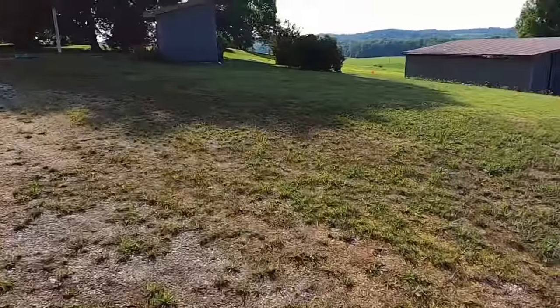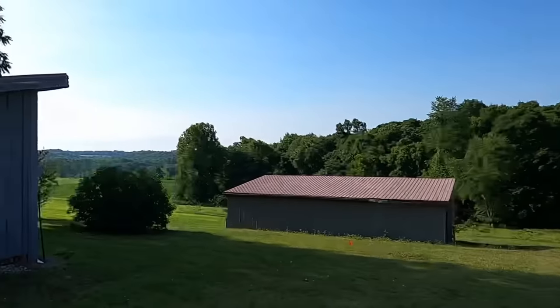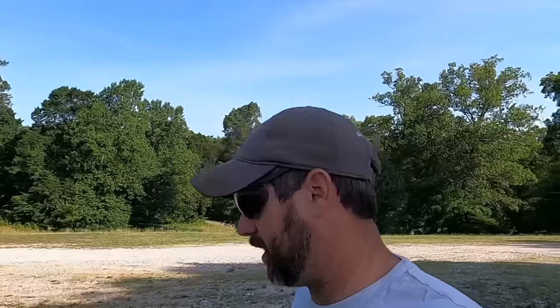First thing we're gonna do is come in here and strip this topsoil. It's mostly gravel. I don't know if there's much to save. We'll save what we can. And then we're gonna have to go down. They got 15, 20 acres here, but down over the hill there somewhere, there's a little like camelback in the field there. So we're gonna go down there, drop a bunch of dirt, haul it up here, shove it in lifts, level it off, compact it, and hopefully we end up with a building pad. So first things first, let's strip some topsoil.